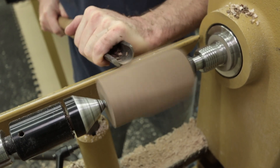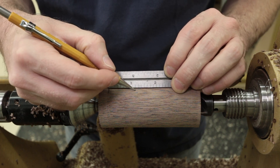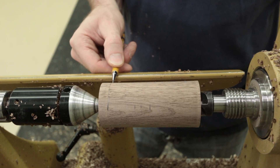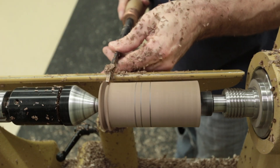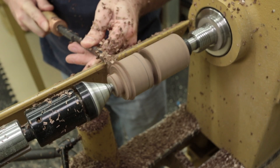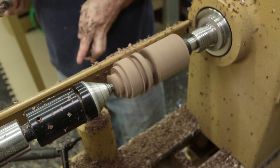For the top hat, I start with a two inch square blank that is at least two and three quarters of an inch in length. From one end of the blank, I make a mark about a half inch in from the end — this marks the top of the hat. From this mark I measure down an inch and an eighth to the top of the brim. Another mark is made at an inch and three eighths for the bottom of the brim. The final mark is for the tenon at one and three quarters of an inch. The waist above the top of the hat is turned down to about an inch, and the tenon is also turned down to about an inch. A reference cut is made at the top of the hat at an inch and a half. The second reference cut is made just above the brim at an inch and an eighth.